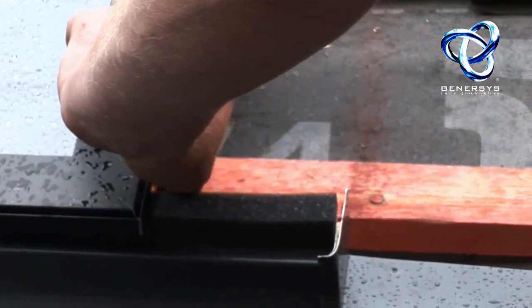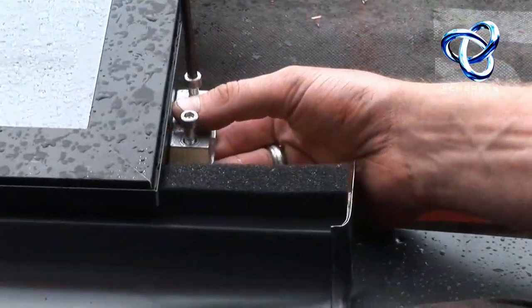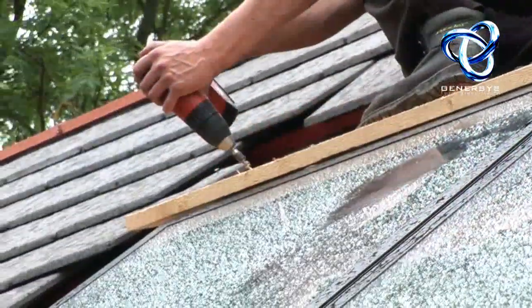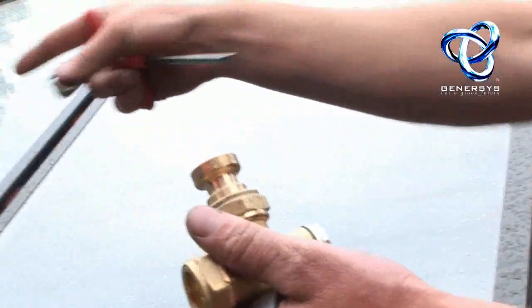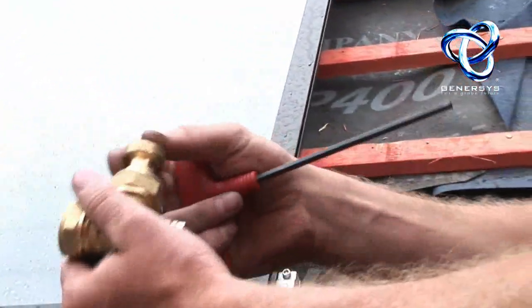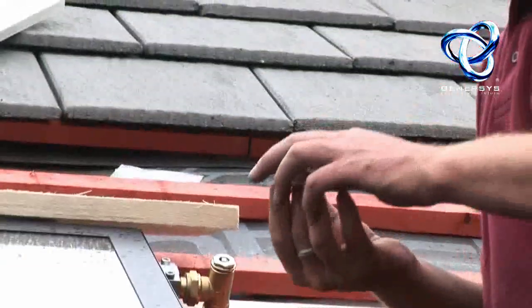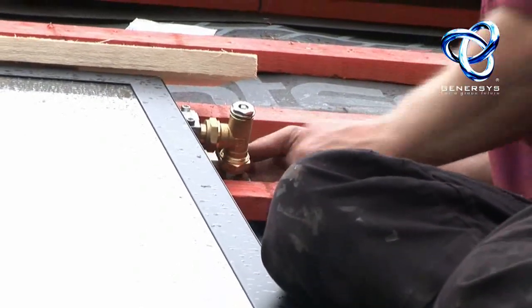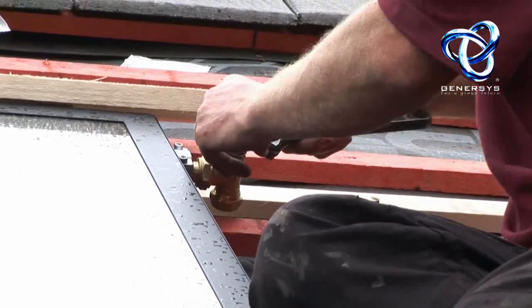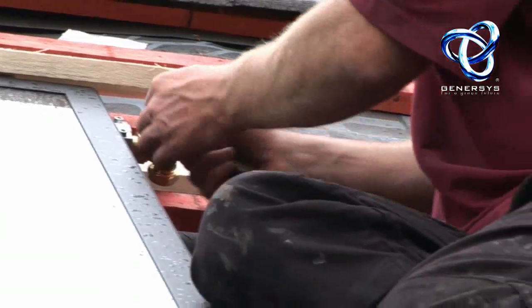On the right-hand side of the array of panels, where there are no more panels, we put a sealing cap. That's in the right-hand bottom. On the right-hand top of the panels we fit the return. You'll see the bleed valve on top — place that so you can get access to it if you need to.